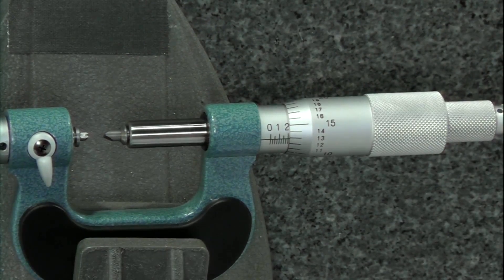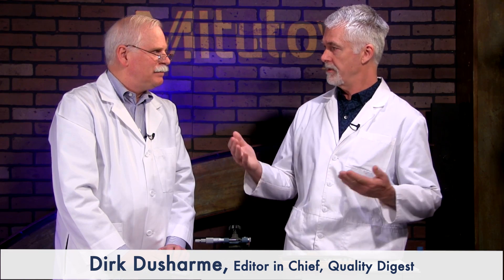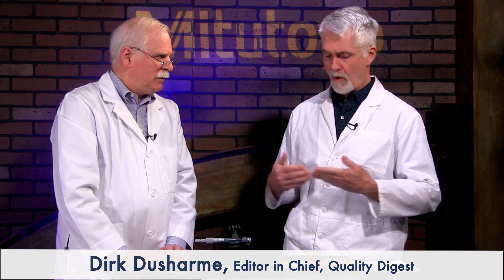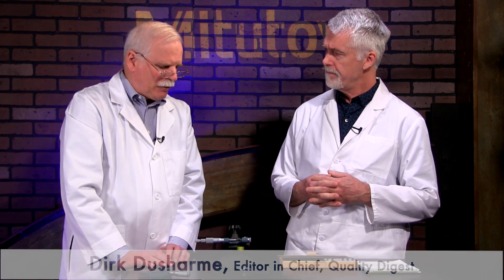So this becomes a very versatile tool you could use for a number of applications. Beyond thread pitch and wire crimpers, you could use it for measuring inside diameter to a flat surface — that's always a problem because with a blade you'll have some error since it's round and squared off. When you're using round spherical anvils, you're hitting tangent to tangent, and you've zeroed it on the micrometer, so you know you're set.